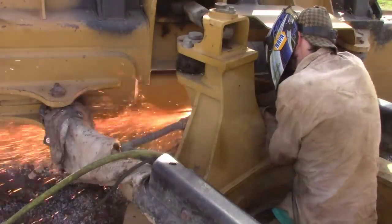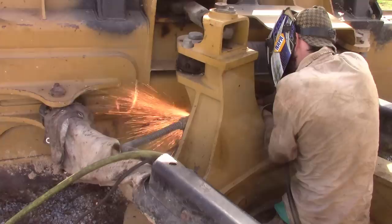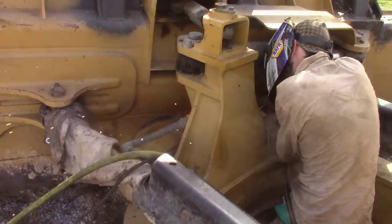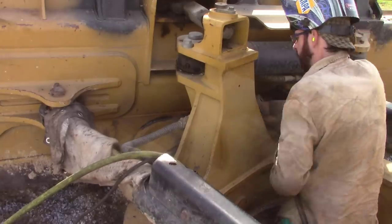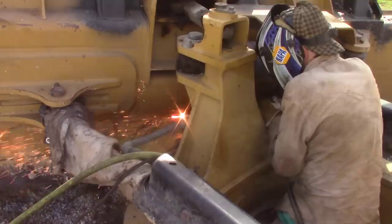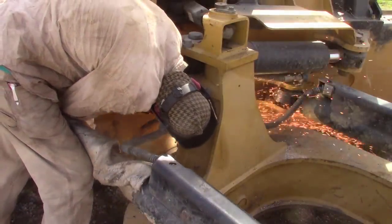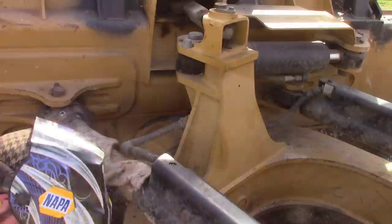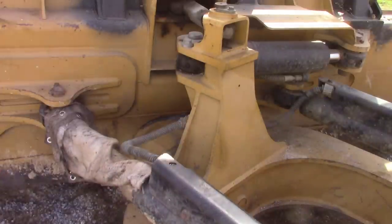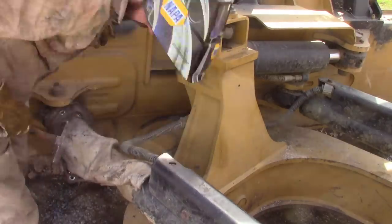And the other benefit to having a small stick out like that is you don't have any stick sticking out the back or the side where you could accidentally arc against something. I've had that problem a bunch of times. Carbon gouge is not one of my favorite things to do because it's nice, it's real nice, but in certain places like this right here where room is a premium, it is not my cup of tea. It's a useful process, but there's a lot that could be better, I would say.